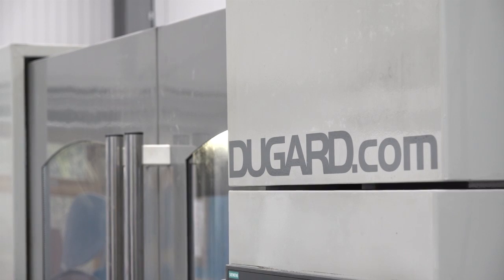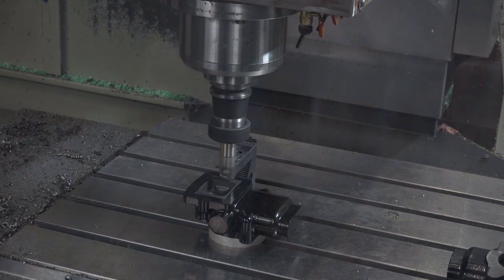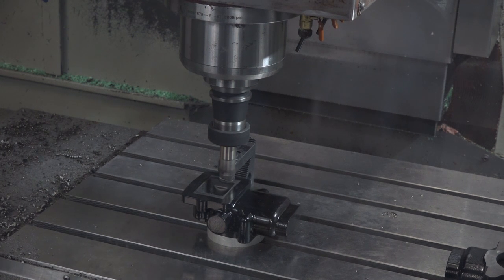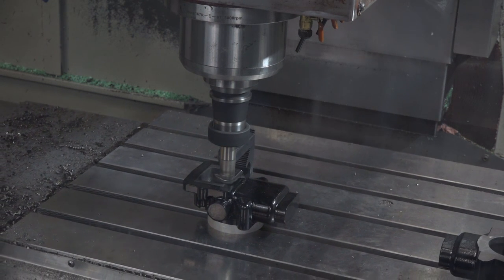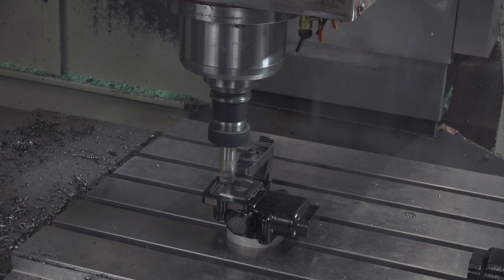This one's cutting in anger behind us here, but what stands out for you? What do they do that makes you think they're more than an economical purchase? We've recently been able to increase our depth of cut — experimenting — and we've been absolutely amazed at how we've been able to speed things up. With an economical costing machine you wouldn't think you'd get that. We've started taking one and a half to two millimetre cuts and running them at eight to ten thousand feet, which for an economical machine doesn't seem to match up really.